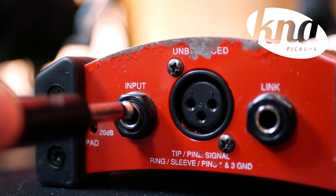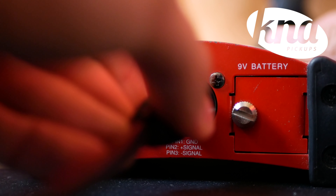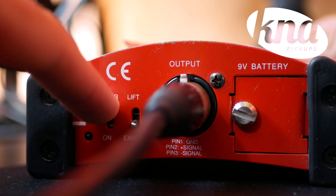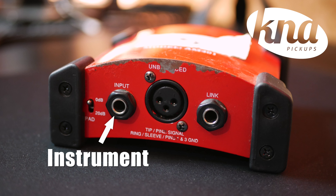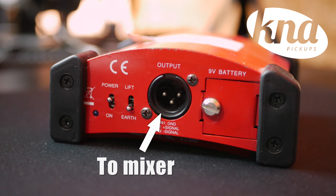It's very easy to use: just plug your instrument cable into the input of the DI box and plug an XLR cable from the output of the DI box to the XLR microphone input of your mixing desk. Don't forget to switch the DI box on. Very often, you can use 48V phantom power — available on most mixing desks — to supply the DI box, so you won't need to use a battery or a power supply. You can also use the parallel unbalanced output of the DI to send your signal to an amplifier while the balanced output is connected to the mixer.